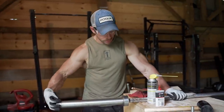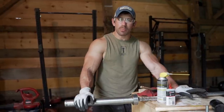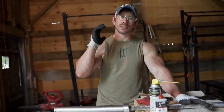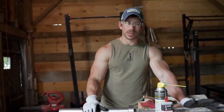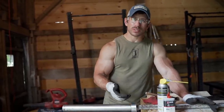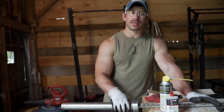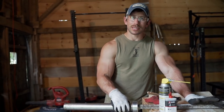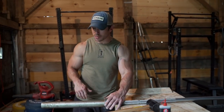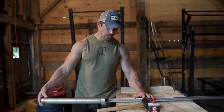This thing was completely seized up before — definitely unusable. It's not smart to use a poorly spinning or seized barbell. If you're going to snatch or clean and jerk, that bar needs to rotate to be safe for your wrists, shoulders, and arms. If it doesn't rotate and someone doesn't know that, odds are you'll end up with a wrist injury. Take care of your barbells — make sure sleeves and collars spin nice and smooth. She's spinning good again: completely locked up, took it apart, cleaned it, hit it where it needed lubrication, and now it's spinning well.